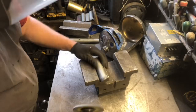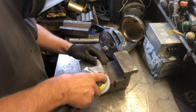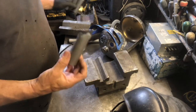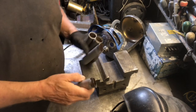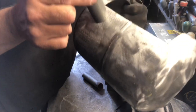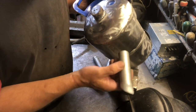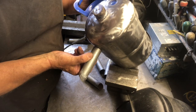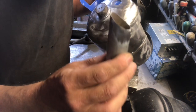Coming on. We've got the legs. We've cut the legs to a height we think it's going to be right. Because we're going, so they say, tube against tube. I don't even get that angle just right. Okay, because we're going tube against tube, it would be rather splayed out or have to be vertical. So to get it coming out at an angle that I like, you've got to chamfer it.